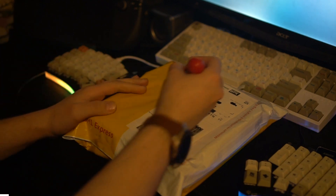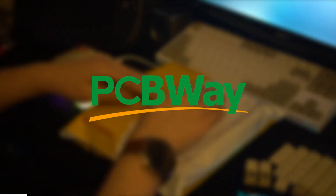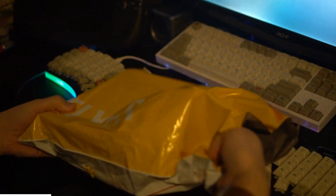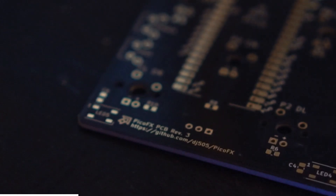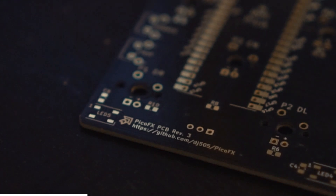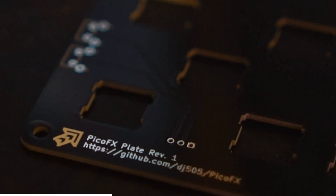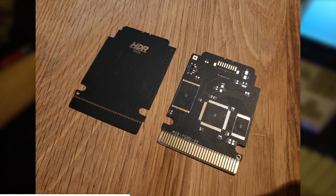Before we get to the closing section, I'd like to give a huge thank you to PCBWay for sponsoring this video. They were generous enough to provide the PCBs used in this video free of charge, but all of the opinions expressed are entirely my own. These PCBs look fantastic. I went with the standard black solder mask for both boards, with an electroless nickel immersion gold finish on the main PCB, which improves solderability and gives you a smoother surface for placing surface mount components. Since the plate only has a few small through hole solder points, I decided to go with a less fancy lead free solder finish. I've also used some PCBs that had their matte black finish, and they honestly look really good as well.